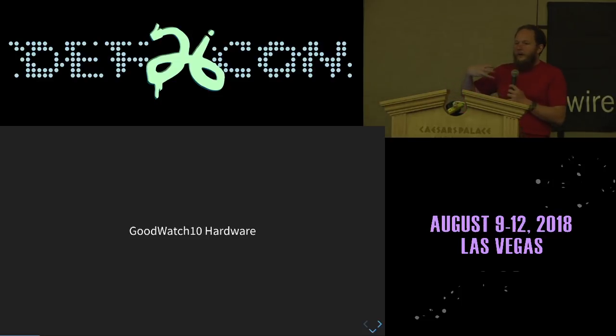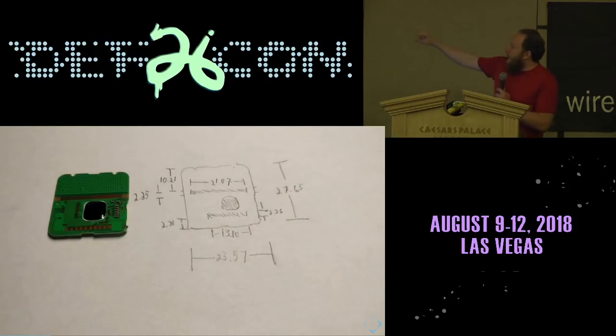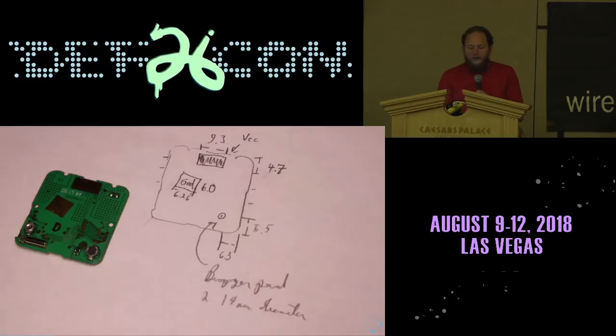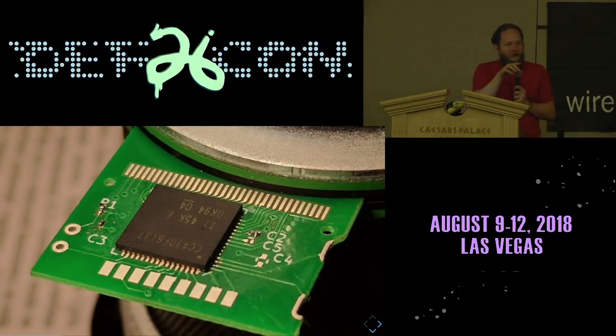So when you have an existing watch and you want to replace it, you first need to understand what goes where and why. The Goodwatch 10 left out the radio and was my prototype to figure out that the LCD layout was correct, that the keypad layout was correct. I began by using a micrometer, a vernier caliper, to measure all of the dimensions of the PCB. So first I need to know how wide it is, how tall it is, where the screw holes are. And I drew all this out on paper and then recreated it in the CAD software. I did this for the front of the board, for the back of the board. And then I made my own board that matched those dimensions. So every keypad pin has to be in the same place. Every LCD pin has to be in the same place.